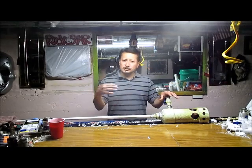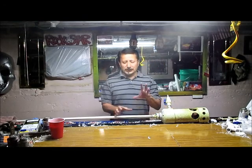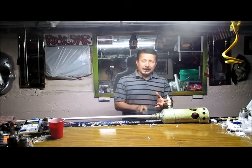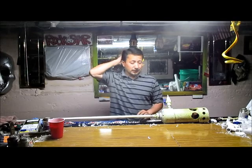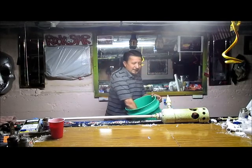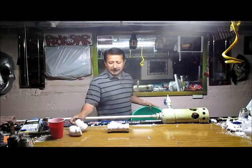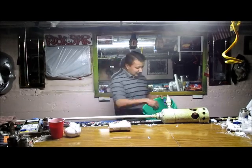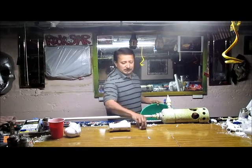I have a filter with a five gallon setup to carry me through wintertime. What I'm going to do is adapt this to inch and a half pipe with a Y fitting, so I keep the water pump pumping up into here and the air pushing it further to get more water flow. I've got inch and a half pipe already in place but had to buy a bit more. The main line is going to adapt from here — I'm going to cut this and put an inch and a half right here.